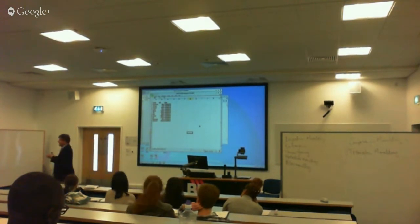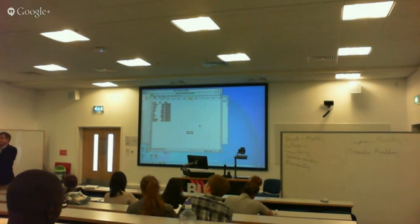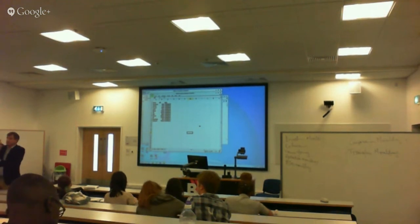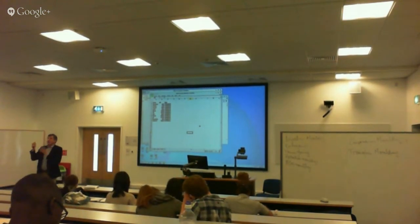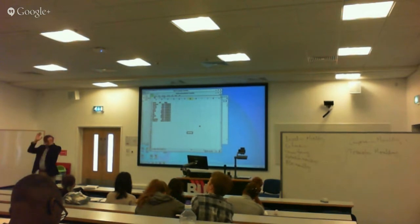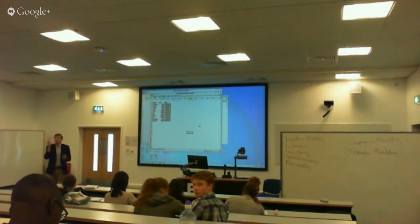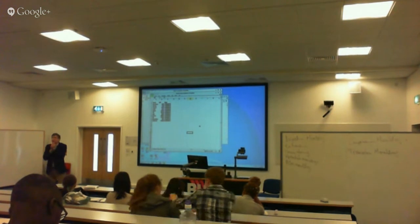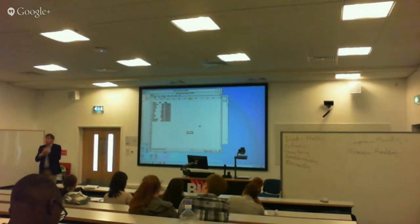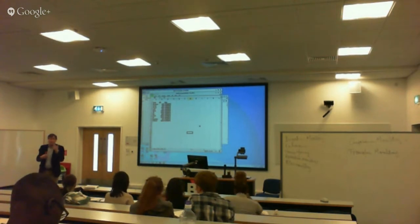Heat treatments. Let's start with general heat treatment. Some basics you should know. What type of heat treatment do you use to make a metal less brittle? Thank you, that is the word, annealing. The process of annealing reduces the internal stresses, and makes the material tougher, easier to shape and all that. Nearly always, if you want to do press work or cold forming, you first anneal them. You prepare them by annealing them.